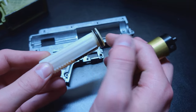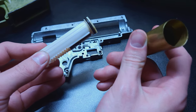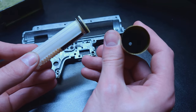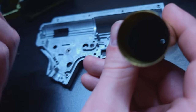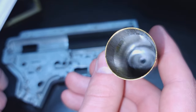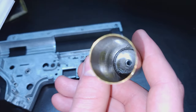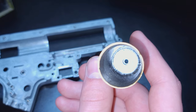A lot of times you want to just replace this O-ring and make sure your cylinder is nice and clean in there. Because if it has scoring and stuff, it's not going to seal well — it's going to tear apart O-rings. And you want to just lightly oil this stuff. You can see this one's worn — look at all the scoring in there. That's one of the reasons why this seal was worn out. This is just old parts we had lying around as an example.